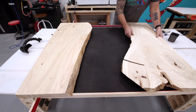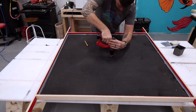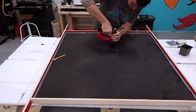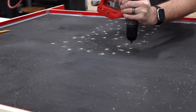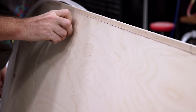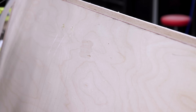I had 200 tiny holes to drill and then 200 tiny fiber optic strands to poke through the panel one by one. As I was drilling to keep track, I would do 10 holes at a time and then make a little tick mark so I could quickly see how many holes I had drilled. With all the holes drilled, I cleaned up any tear-out on the underside of the panel and began that tedious process of poking those 200 individual strands of fiber optic cable through the holes.